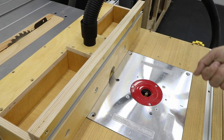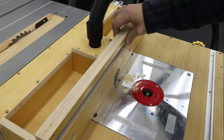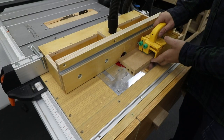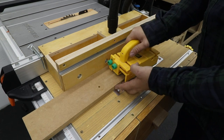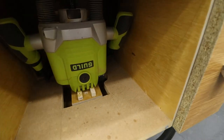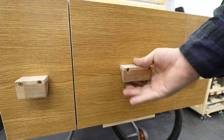Let's test it to see if it actually works. From the fence there seems to be a good solid amount of dust extraction, which is great. Now let's do a bit of routing to see if I get sprayed with dust. And as you can see, it's actually not too bad — with a straight bit you always get a little at the top, but inside the box there's no dust at all. I also had a look inside the dust trap underneath and it was empty as well.